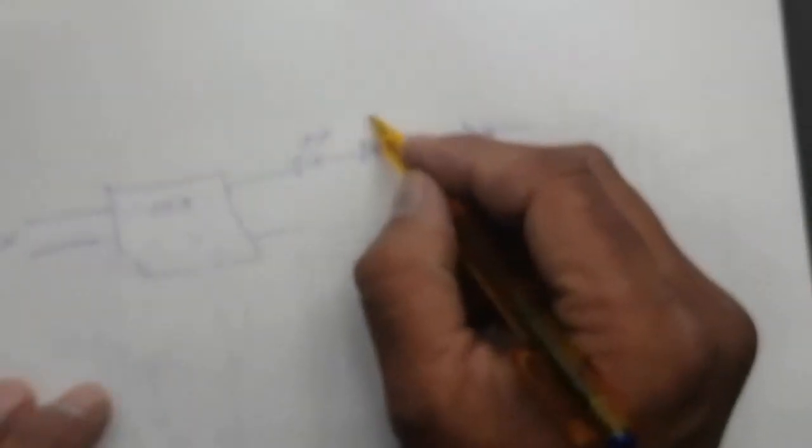Now I will discuss how it works. First of all, it takes 220 volt or 110 volt, whichever line voltage is available in your country. After that, there is a power supply circuit. I will discuss in detail. There is another very detailed video on how a switching mode power supply works. Now I am making a block diagram. The first block is the power supply circuit, and there is the LED circuit, the LED series panel. These LEDs we were testing in cold testing and warm testing. These are all connected in series.